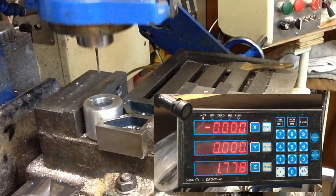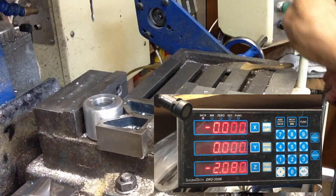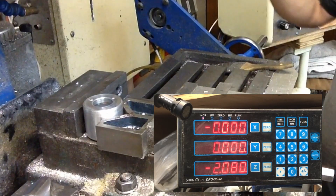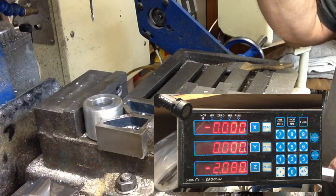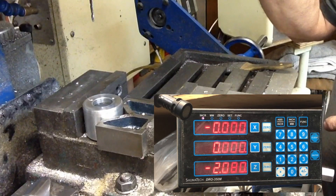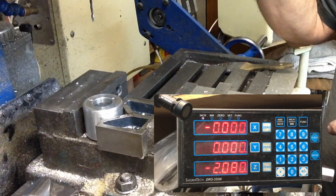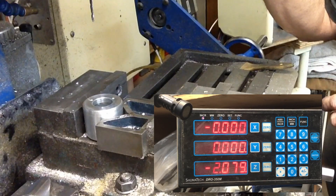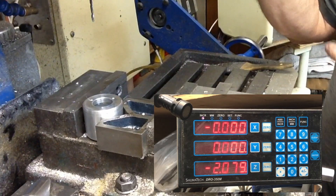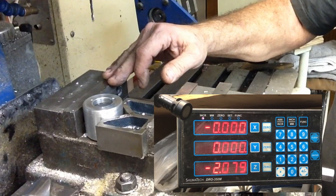Back centered up again. In days past, the common way to do this probably would have been on a rotary table, or it could have been done in a lathe — indexing off the index wheel on the main bull gear, or on a little Atlas lathe off the index wheel. A crude way would have been to index it off your three-jaw chuck with a Dremel or something mounted in your tool post, offset the proper amount. Anyway, the three common ways would be a rotary table, CNC, or the digital readout as we did here. We'll burr these holes and tap them, then do the other one while we've got the setup here and this project will be good to go.